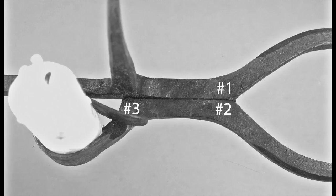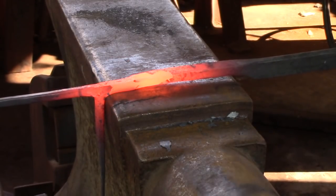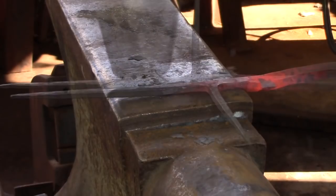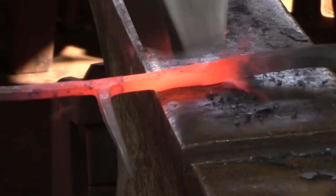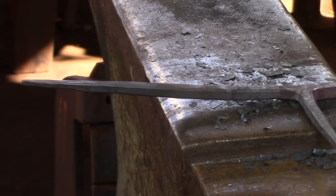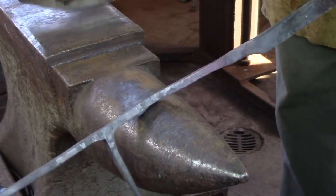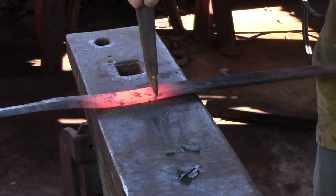I have three sharp corners on my version of the miner's candlestick. There are various ways to create a sharp outside corner on a bend. I am going to use the draw-away method, isolating the extra material needed in the bend for the corner. With the hook pointing to the bic, lay off approximately one inch from the edge of the anvil to the nearest side of the hook. Set the material down to about 5/16 of an inch or so. Take another heat and then, crowding that corner on the opposite — off-side — edge of the anvil, set the material down again, leaving a peak of material that will later become the outside of our corner bend. As we already have heat in the bar, draw down what you can of the eye for the candlestick to a fat quarter-inch square. Take a heat at the 9½ inch mark and sever the candlestick from the remainder of the bar.